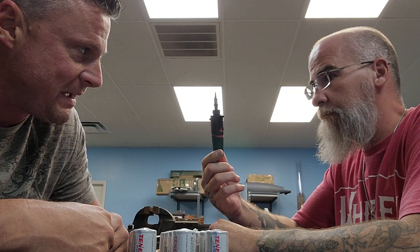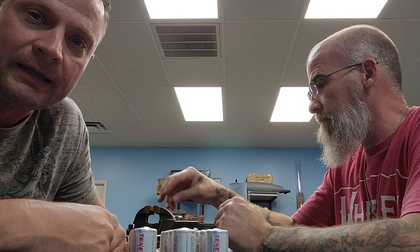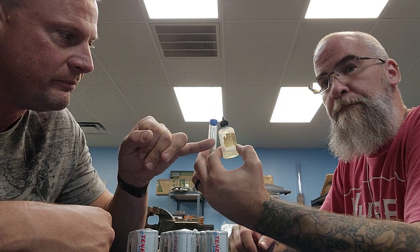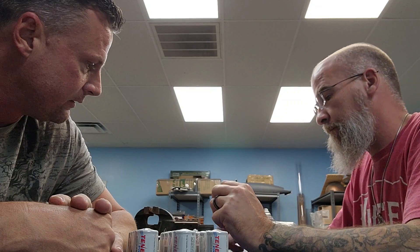This is what we're going to use to connect each one of the cells together. Next up, a super-hot soldering iron. We're going to use our little gas-powered one because it puts out some pretty tremendous BTUs. We do not want to dwell on the cells so that we cook them — we want to put as much heat as we can into as concentrated an area as possible. Low-temperature solder. I've got liquid flux, but you need flux of some kind to make sure that everything sticks.